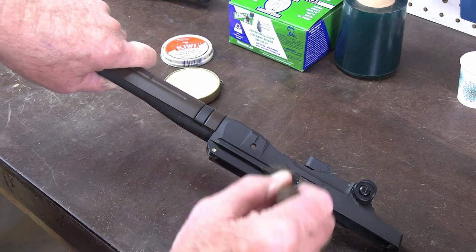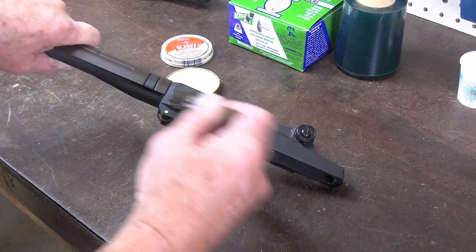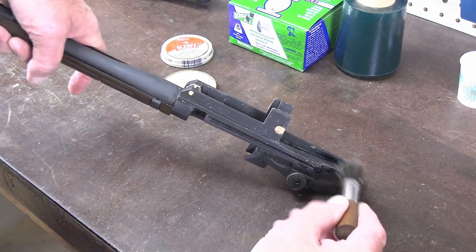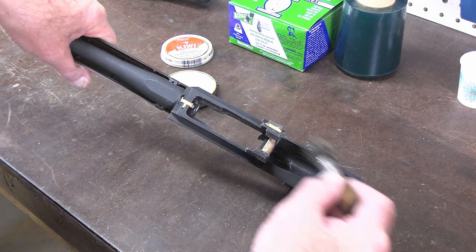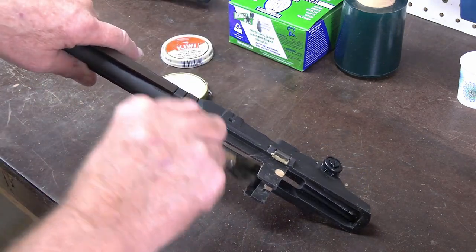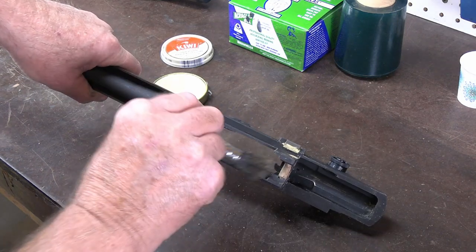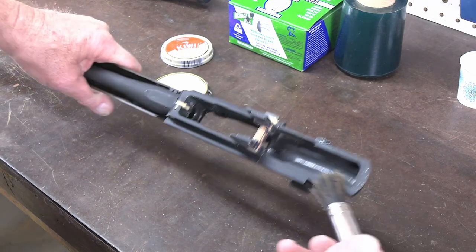Go up a little bit on the sides. You don't have to go crazy, just go up against the sides a little bit in case you have any epoxy that works up. You should have none whatsoever back here, but just the same. And it provides a good sheen and protection to the steel too, so no problem at all. Just kind of buff it on. I like to spend 4 or 5 minutes at it just so that the brush is absolutely certain of contacting every spot. Be very careful to take note of putting it on this back recoil lug surface, and just clean up any excess. It's shoe polish, so it does harden and dry in contact with the air. So that's really what we want.